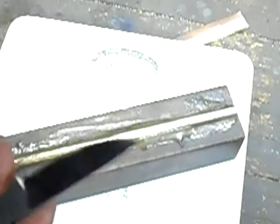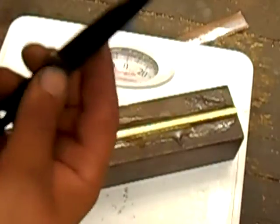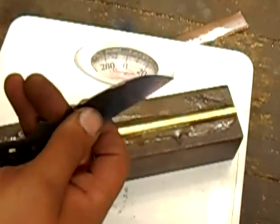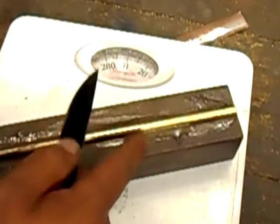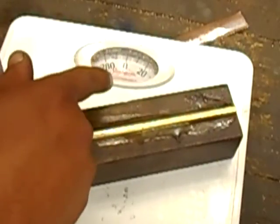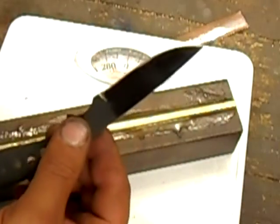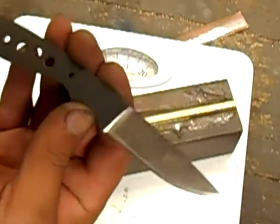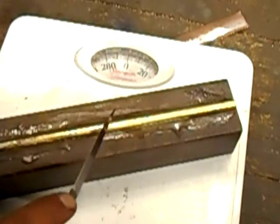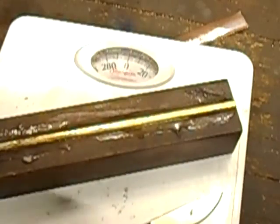That's a set that's about 1 to 2 thousandths to the right, out of line with the rest of the edge. That tells me the heat treat for that blade is spot on. You could take another knife and do that same edge deformation test — if it's grossly too hard, it would have chipped out under 10 pounds; if it was grossly too soft, it would have bent over under 10 pounds. But to get that kind of pressure and that kind of angle to get that slight amount of damage tells me the heat treat is pretty much as close to perfect as I can get it, at least at this time. I've only been working with 440C for a couple of weeks, so there's still work to do, but that lets me know I'm in the ballpark. That is the difference between a traditional brass rod test and an edge deformation test. Hope you enjoyed it, and we'll see you next time.